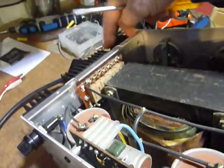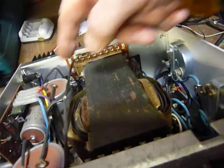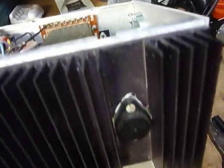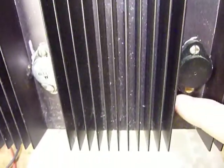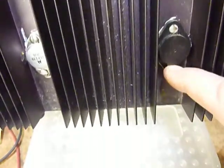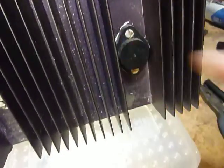There's also one back here. This transistor drives the other four power transistors. There are two heat sinks — one in the back and one in the front — and some really big filter capacitors in here. This is a nice power supply and I want to use it on the bench, but I found when checking it out that by touching these screws, some of them were very hot, and the reason is because of this corrosion — you've got resistance there.